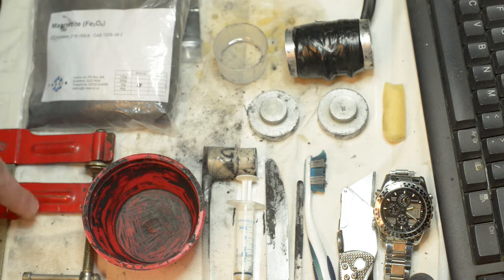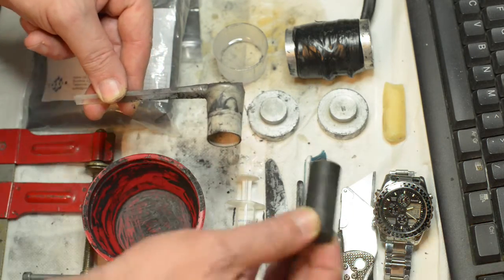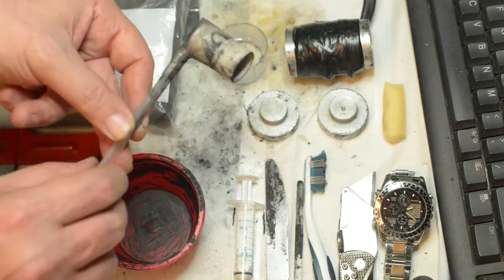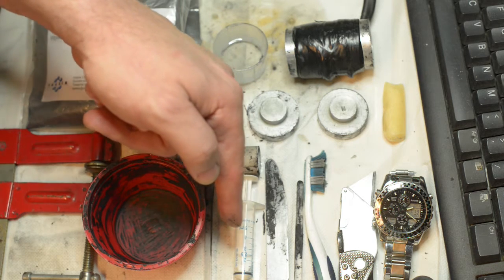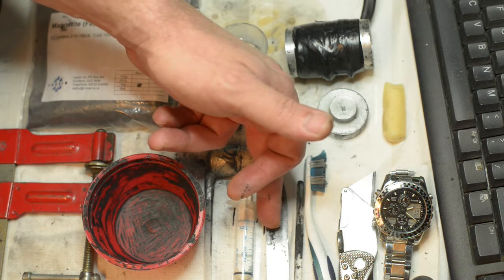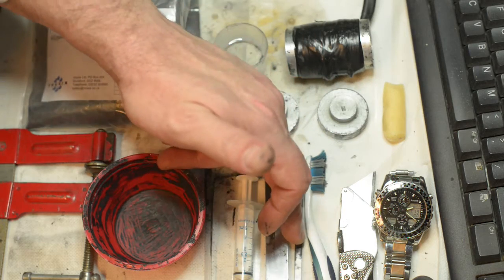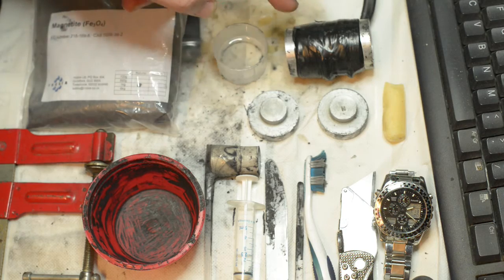a clamp, plastic mixing bowl, a crude but effective measuring device whose internal volume is the same as 75% of the overall volume of the end result. The syringe is used to measure out 2.5 milliliters of epoxy resin hardener, and the knife is used to stir the mixture and help separate the components of the mold later on. The plastic is used to compact the contents of the mold, and I can't stress enough how important that is.